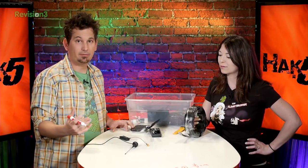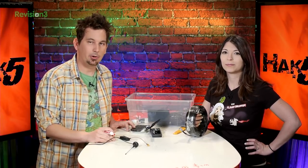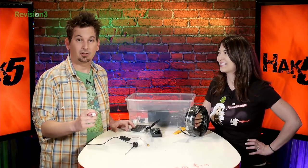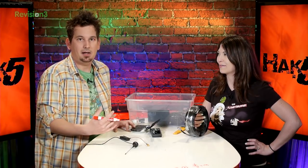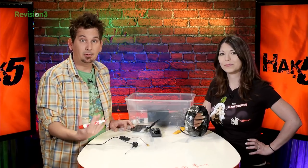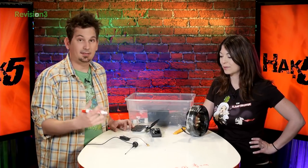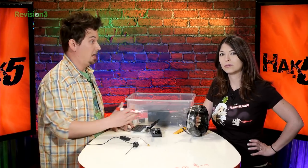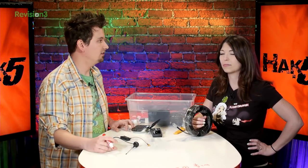This is just one of the values we're going to throw into our maths as the rubber hits the road, because our velocity factor is going to vary depending on what our transmission cable is. For instance, a closed cell foam dielectric may have a velocity factor of 90%, while Teflon, for instance, could have one of, I don't know, something like 70. And this all needs to work into our math as we cut our elements to length.